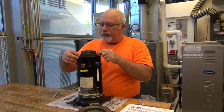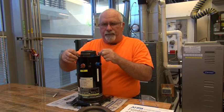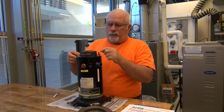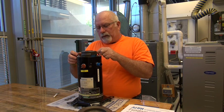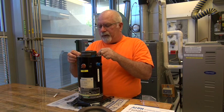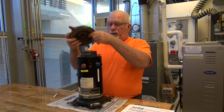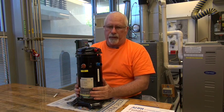At the bottom of this is oil — refrigerant oil — and that refrigerant oil has to match whatever refrigerant you're working with at the time. You can't put R22 refrigerant into a system with 410A type oil; you can't cross-contaminate. So be very careful what you're doing and how you're working it, and understand everything you need to in order to explain to your customer why their compressor isn't working.